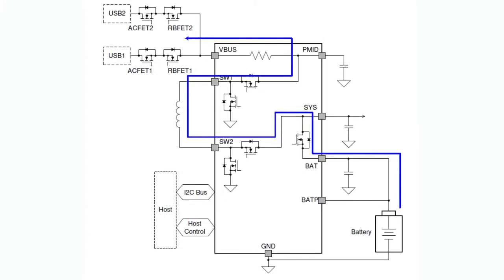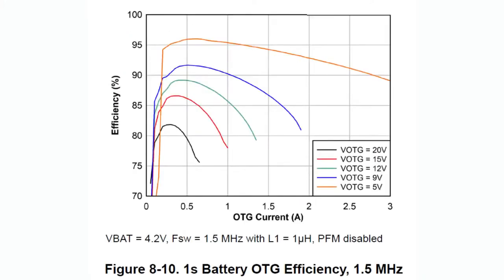Finally, there's on-the-go mode, where instead of using the buck-boost to charge the battery, the battery goes backwards and is buck-boosted to an output voltage you set over I2C. So it can be a 5-volt or 12-volt output boost or buck converter — especially useful if you're between the battery's nominal and peak voltage. You don't have to use it; you can just take the system voltage out and get the battery voltage. It does power sharing — if powered over DC, it won't drain the battery. When DC is connected, it charges the battery instead. You can get about half an amp to one amp from the on-the-go converter.